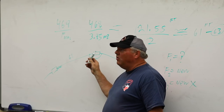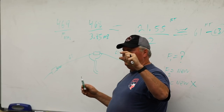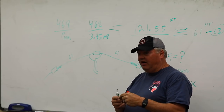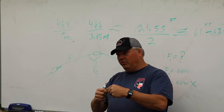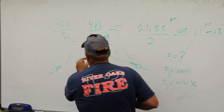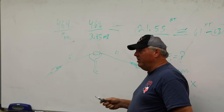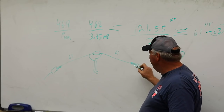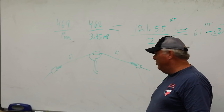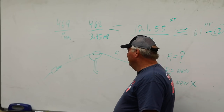Another thing you can do, and I don't recommend this, is get those little teeny inline splices. They're called ALCU, from the electrical products aisle. On one side you put some antioxidant on the aluminum, stick it in there, and screw it down really tight. On the other side you put your copper, with that stuff on there. Also, depending on how malleable aluminum wire is, you have to be careful not to break it moving it back and forth. Some guys try that with loop antennas, and I've seen mixed opinions. You know, it works.